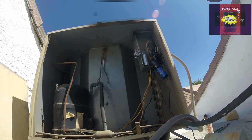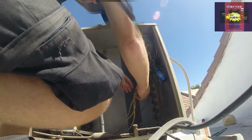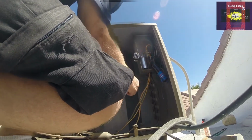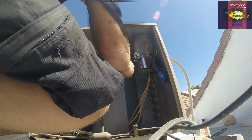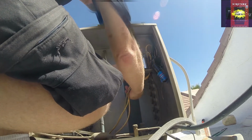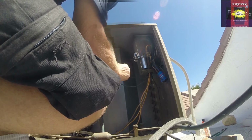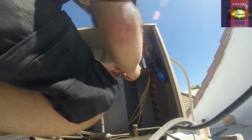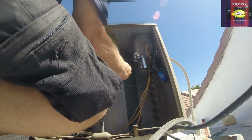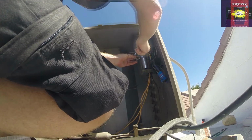Completely broke apart. Then with the gloves, we've checked our compressors already. Okay, so the white one's gonna go to yellow, and to blue, black one to black. Then our two leads to the capacitor is black to black. Capacitor leads. Ooh, that one's a little loose there.